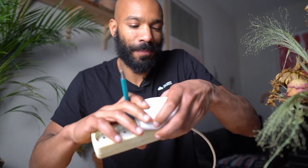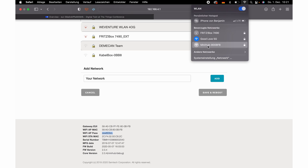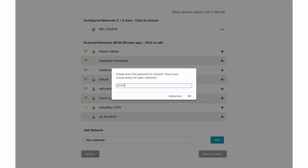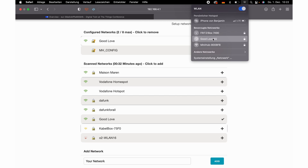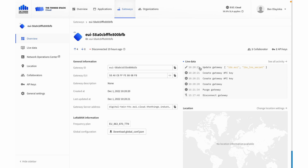There's the reset button. Then I hold the setup button again for five seconds to expose the Wi-Fi access point — now the light's blinking orange. I jump back into the configuration and connect to the access point at 192.168.4.1. Then I need to point it to my Wi-Fi so that the gateway has internet access. Choose your network, enter your password, and all you need to do is save and reboot. The gateway will reboot; we connect back to our actual Wi-Fi and go back into the console. We can refresh this page — as soon as the gateway comes online, we'll start seeing uplinks and gateway status information.